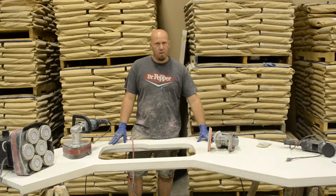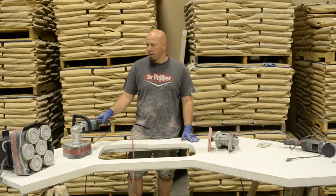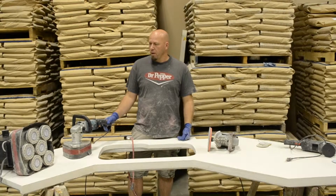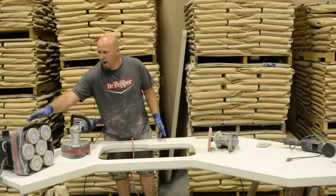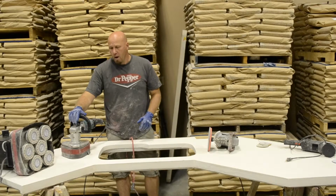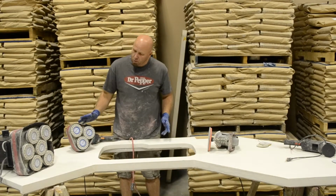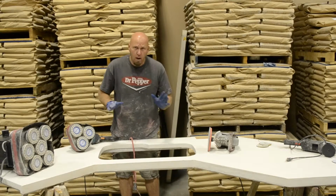The thinner, the tighter you can get your grout without leaving divots, the better off you're going to be doing the grind. We've got several different tools that we're going to use here. This is new Grinds machinery that we have over here. We have the Baby Rhino, and then we have the Rhino RXS14. Both these two tools work really great, so if you can afford to get these tools, these are the best way to go. And these diamond sets cut the best.